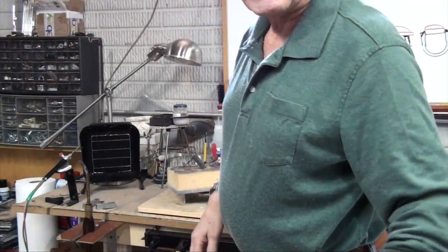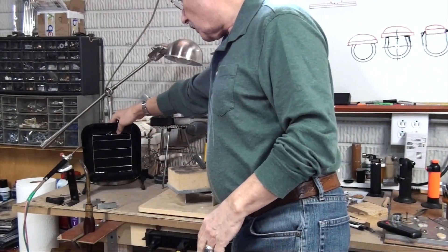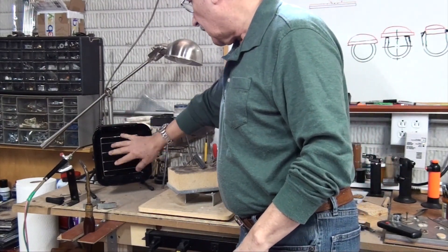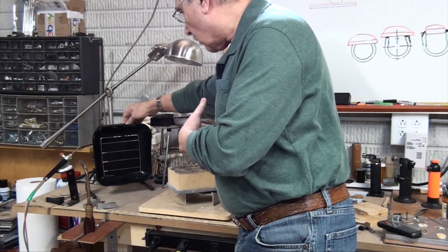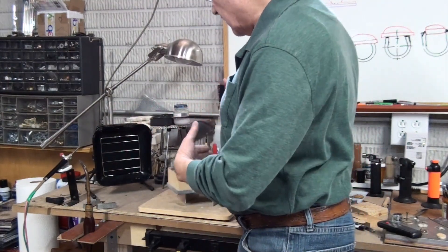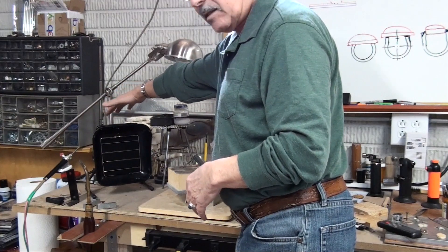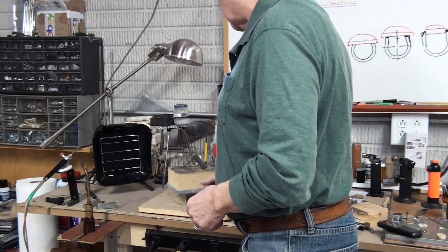The other area is the soldering area here. I got my torches down here. Now I want to show you this — it's a small fan with a filter in it. See, it will suck the air or the fume in through the filter and it comes out. Is it good? Not really, because even though it takes the fumes away from you so you don't breathe them, it exhausts them on the other side. So it helps just a little bit, but it's not a real solution.